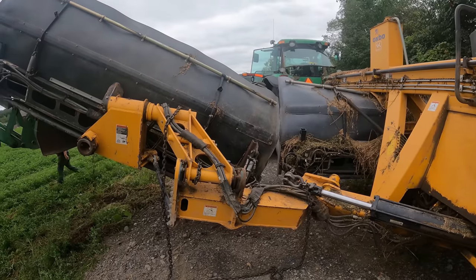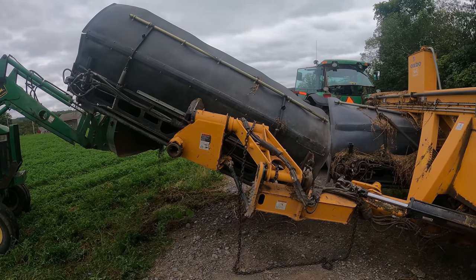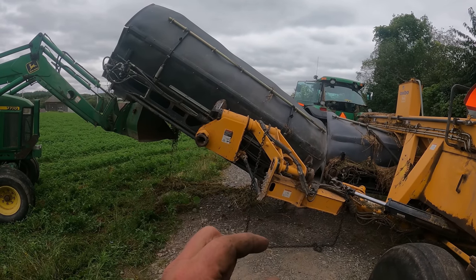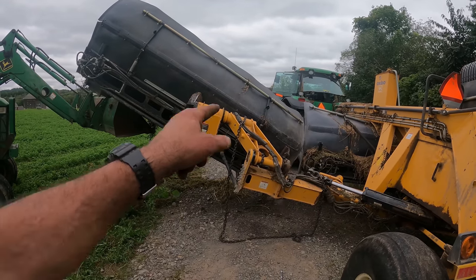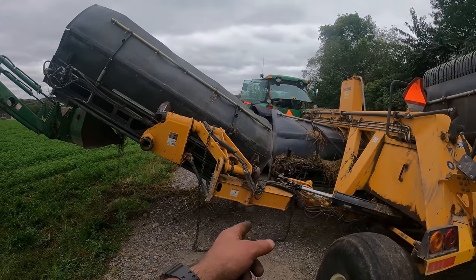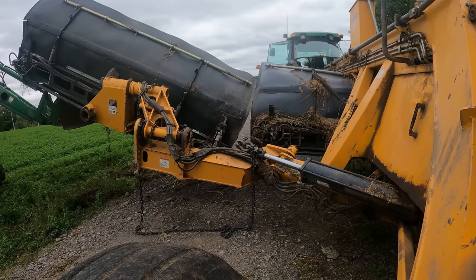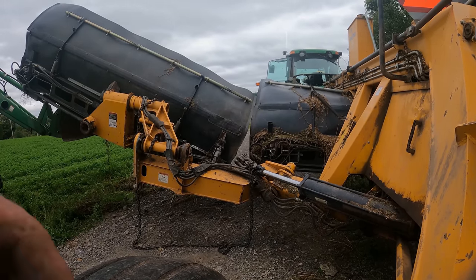All right, so we're going to discuss a plan here. Being that you don't have complete control over that cylinder, I want you to be ready to shut the key off in the event that something goes wrong. So we're going to release that chain, get rid of the clevis, get the cylinder out all the way, then you might have to just slowly bump it back so that we can get that pin in. So I'm going to have two hands held on there. Actually, why don't we dial up on the phone, okay? Jump up in there, he'll call you. You gotta go out first.